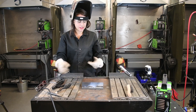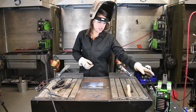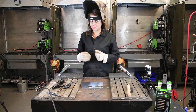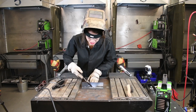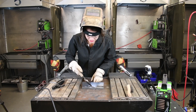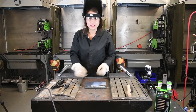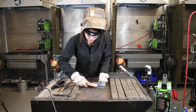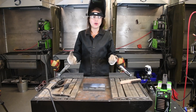So right there you saw it was sticking quite a bit — that's what happens with reduced amperage, it's just not hot enough to get started. This machine does have a built-in hot start, so it boosts your amperage when you first make that initial arc, but it still just wasn't enough. Once I finally got it going, this machine does kind of correct itself, so it did end up running not too bad. But once we remove this slag, you'll see it's a lot harder to remove. Not only that, but you have all kinds of inclusions, which are basically contaminating that weld. It also looks like you just have a lot of little spots, and there are lots of grooves in there trapping that slag — that's what it looks like when you don't have the proper settings.